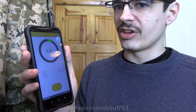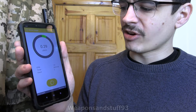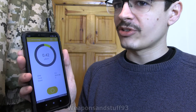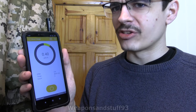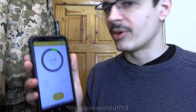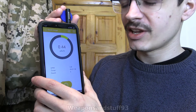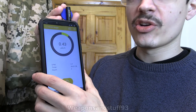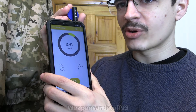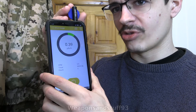So what this does is you turn it on, it keeps running, and it counts how many times something enters it. This one was advertised as only doing gamma and X-rays, but I don't know if that's true — looking at it, I'd assume it's not so thick it would stop beta energy. So we're going to get a bit of caesium-137, hold it against there, and see what happens on the screen — the numbers should start shooting up. It's noticed it's there. One thing I heard in bad reviews was people saying it doesn't record in real time, that you have to leave it running for five minutes for numbers to change — and that's evidently not true from what I've been doing with it.